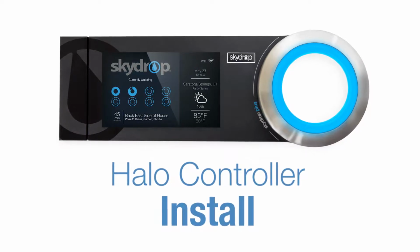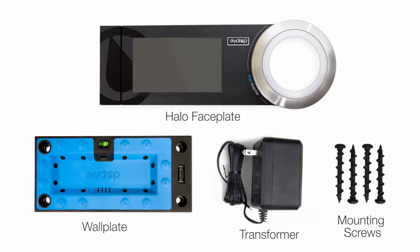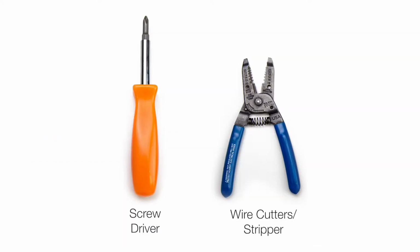Today we're going over the installation of your Halo controller. There are 4 parts that should be present in the packaging: your Skydrop transformer, wall plate, a bag of screws, and the Halo faceplate. You will need a Phillips head screwdriver and wire strippers for installation.